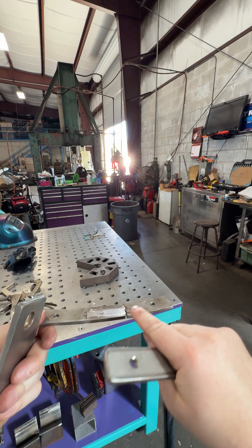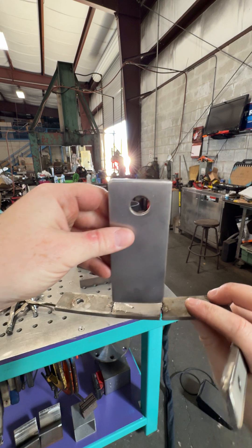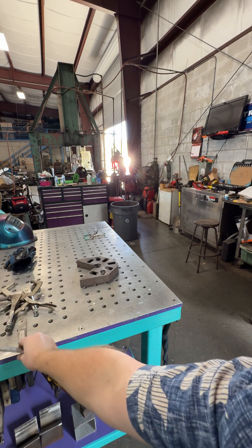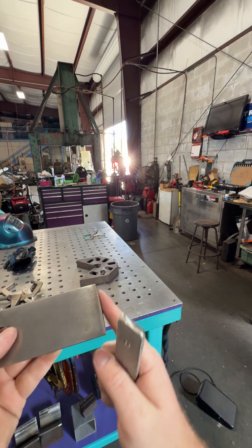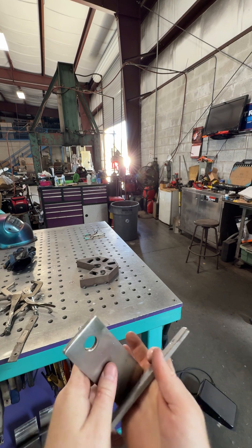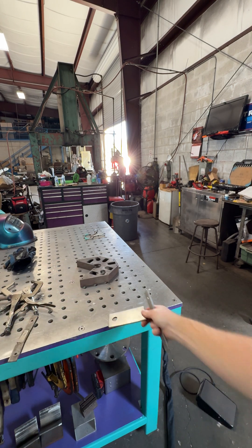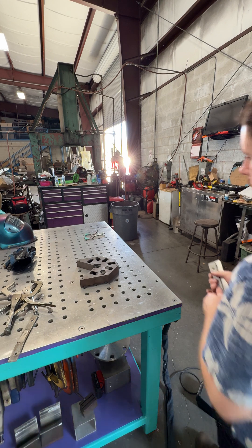The part got all mangled in the storm — Hurricane Helene — this was like a month or two later, and the water bent all this. So I put it on the band saw, chopped that off, and got a new piece. This is quarter-inch thick; the original was 3/16th, so I took a 16th off of here so their bolt holes will line up. I marked out my spots, drilled my holes, and flattened it out a little bit on the press — it had a little bend in it, now it's pretty good.